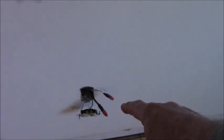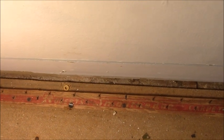And this one over here already has a switch leg. We're going to switch half of it. There's already wires over there, so I just have to rewire that one. But how do you do that? Well, what I did from experience is you get yourself a long screw in your drill. And if you notice, I ran a 3-inch screw